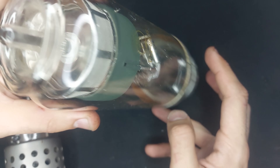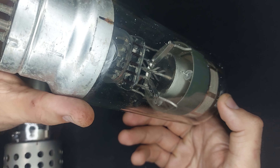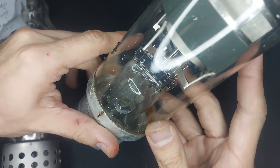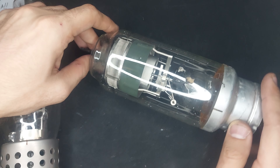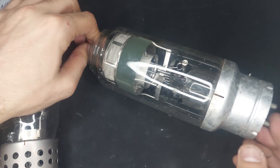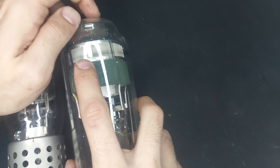Sorry about the hand-holding, but I had to move the thing closer to the power supply because it was dropping so much power over the cables that it wasn't heating the filament up enough. I switched to shorter cables, and let's reignite it — and it doesn't really want to. It's kind of fussy.